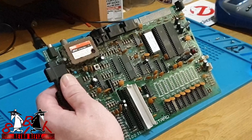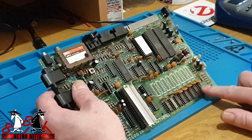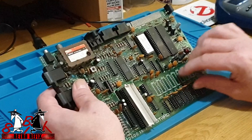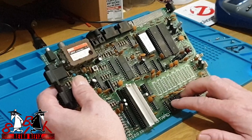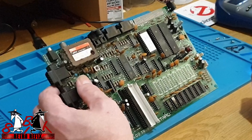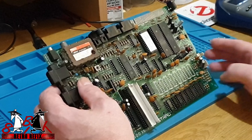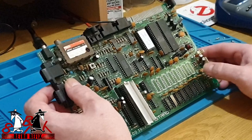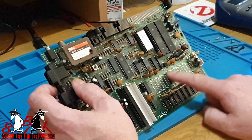I'm going to put the 8 sockets in with the new set of RAM. Then I'll fire it up and see if we can get a difference out of it. If it's working, all well and good - if not, we'll progress and desolder all the ones at the bottom, put sockets in those as well, put a brand new set of RAM in there, and try again.